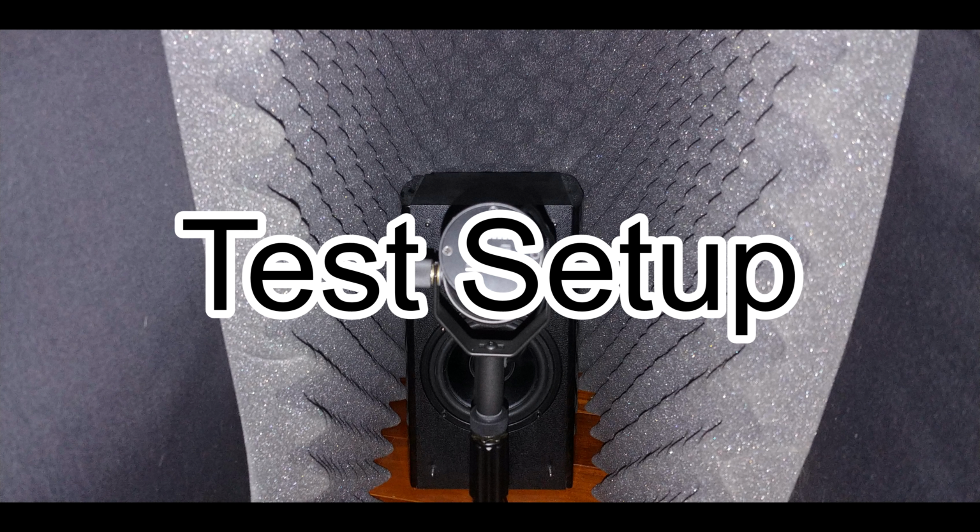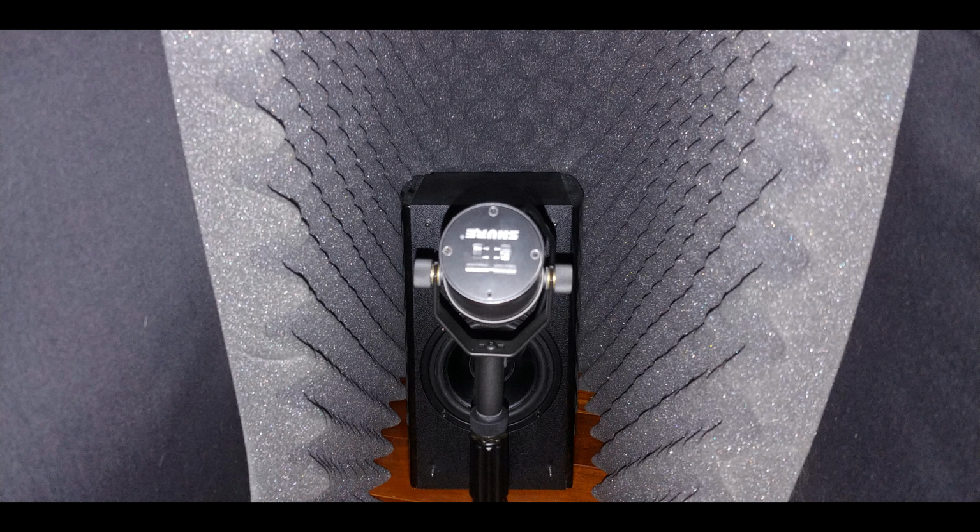So to start off the testing, since we are looking at the quality of the preamps for the purpose of powering a Shure SM7B, I'm going to be mainly trying to test how much gain each preamplifier offers and what the noise floor is for each preamplifier. So in this first test, what I'm going to do is put this microphone into a soundproof enclosure, and I'm going to then generate an audible tone with a speaker. That tone is roughly the same volume as a human voice. And so that's going to give us a control range for all the preamps in terms of max gain.